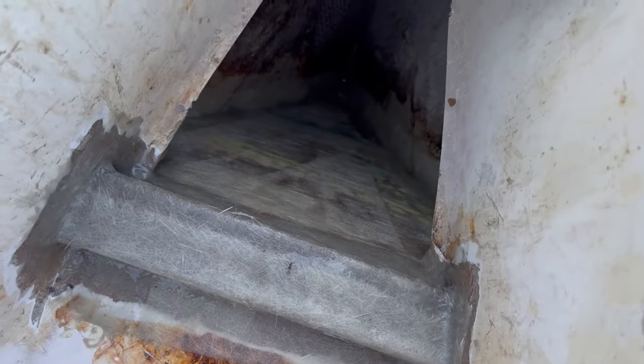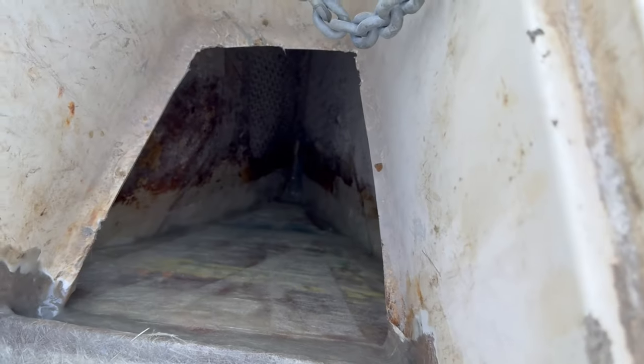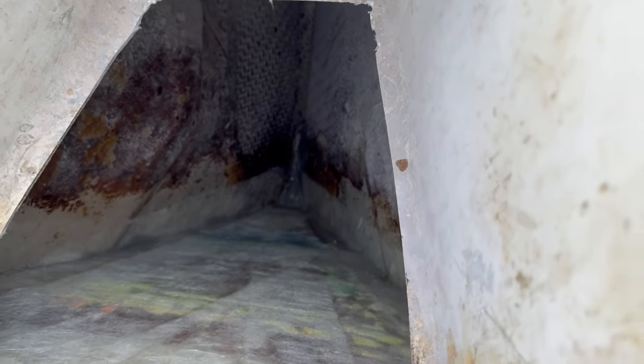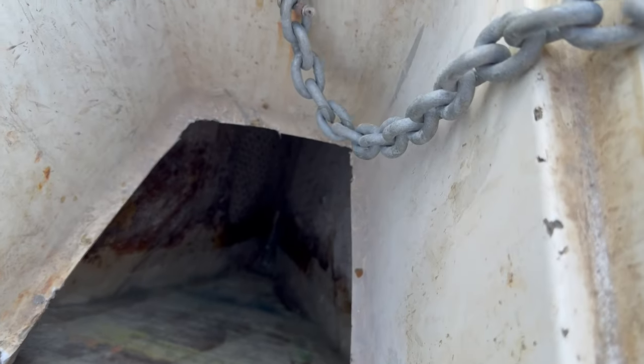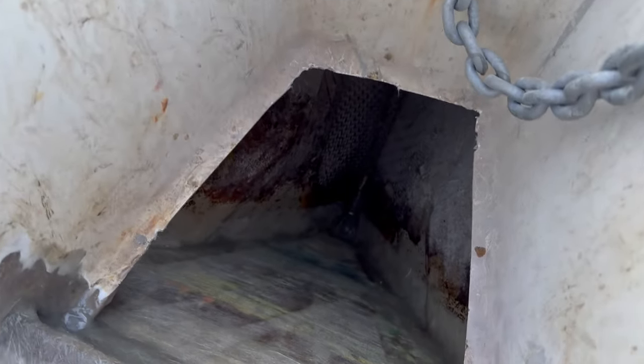It's 20 to 5 and this is not looking too bad. There's only one layer of fiberglass at the moment, but there's quite a significant pocket of thickened epoxy in the bottom, which is good. I'm going to fill that a bit more to bring it up, because I want to make sure I'm well above the waterline before I drill any drain holes. This needs building up now with multiple layers on both sides.